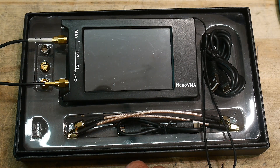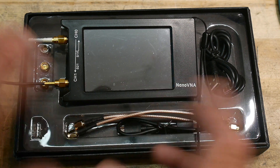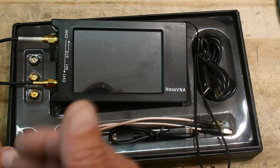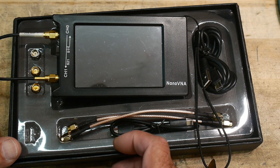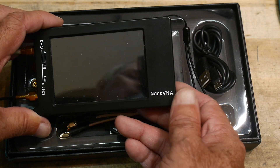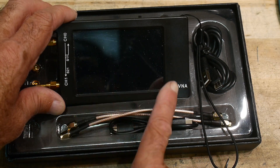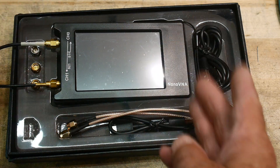The VNA is his own though — he purchased it. It's an old HP VNA, but it's a good one. This video is going to be in two or three parts. First, I'll show you the measurements we did at his house, mostly as photographs with voiceover. Then we'll come back and I'll repeat all the measurements with my Nano VNA-H4, which has the latest Dislord software with 401 calibration points, set to 0 to 1.5 gigahertz. We'll compare both units over that range.